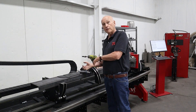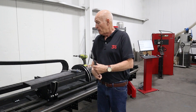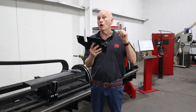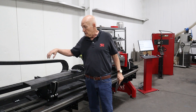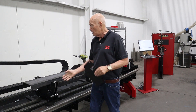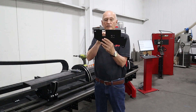Now let's talk about the adapter plates and how we adapt this ring system to different shapes. This is a side plate, and we will be bolting two of these onto the lower half of the ring adapter — one on each side. Do not be tempted to use only one side plate, because if you do, when you clamp down the workpiece it's going to cock over and destroy your cam followers, since the entire ring assembly will wobble. Always use two, one on each side.